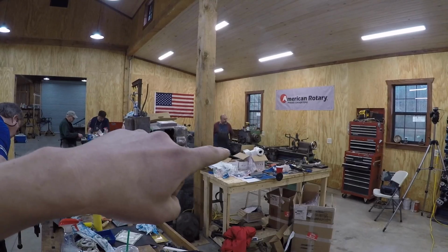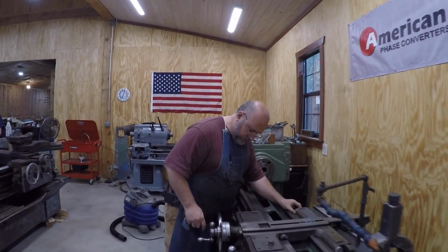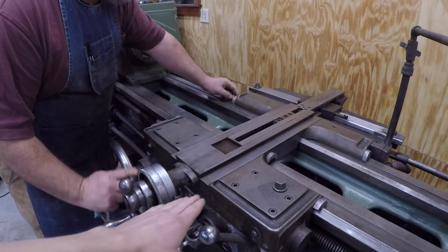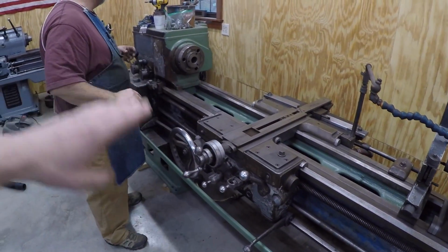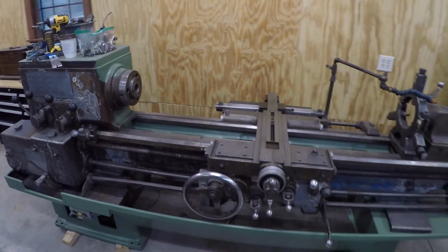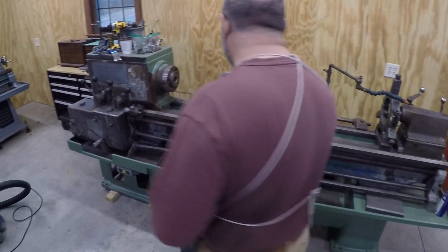And again, looking at Keith Rucker working on his lathe right now, taking parts off of that, I think that's what I'm hoping to get out of the rest of this day and a half, is trying to understand more about machine building and how you do dovetail alignment. We were talking about if you raise and lower planes, whether you shim them up, and how they interface with the screws, because you start moving things around, like heights relative to headstocks and tailstocks, and all of a sudden your head explodes because it's so much more complicated than you might think. And that's what's really interesting, having experts around to do that.